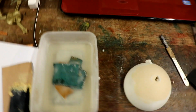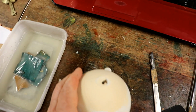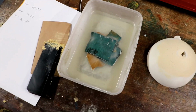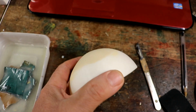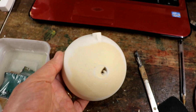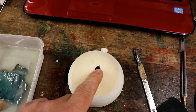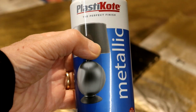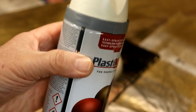And I've sanded down the back of this, the wood filler, which is lovely and smooth, using 2 grades of wet and dry. So, as we were trained at college, I'm now going to spray this with primer, because until you spray it with some sort of paint, you don't quite get the idea of what's going on, how good it is. So I think I'm first of all going to drill out the hole in the middle. Because I use Plasticoat for most of the painting, I'm going to use a Plasticoat satin finish. I haven't got any primer, so we'll give that a go.